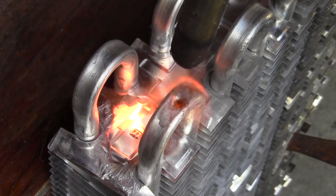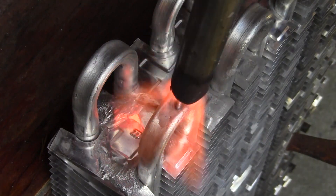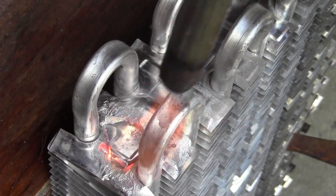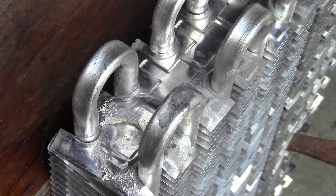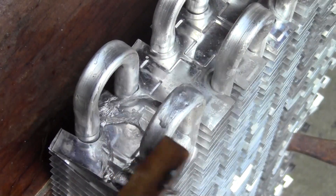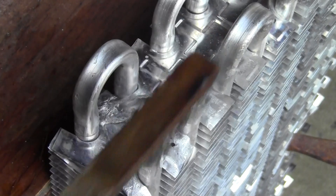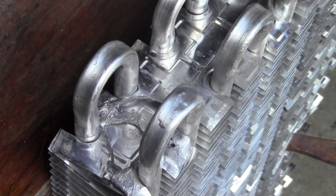Always keep your heat moving when working on very thin aluminum, and stop briefly to apply the rod across the hole. That's it, she's done. You don't need to keep heating. Congratulations Tawny — your very first Super Alloy 5 repair on aluminum. Perfect.